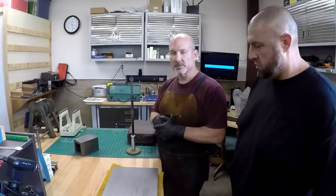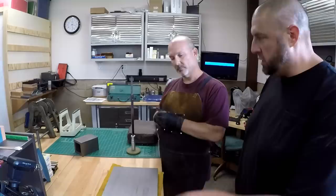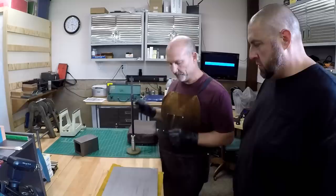That Schütte surface grinder that I just sold, that's a great project. Well, a lot of milling machines too. The milling machine saddles and the knees are just cast iron, so you can scrape those in. And that's a very common rebuild, like a Bridgeport mill.